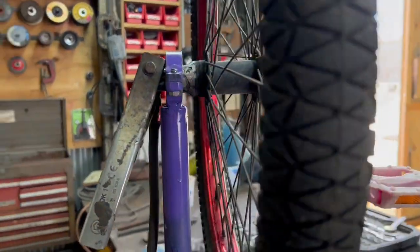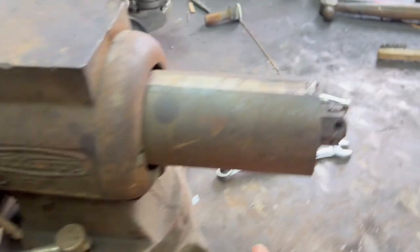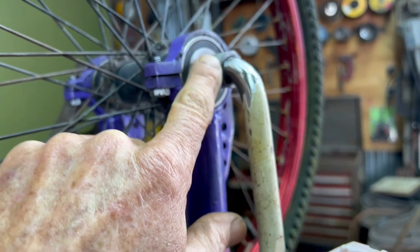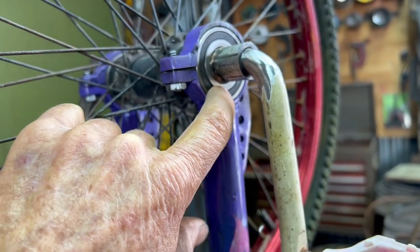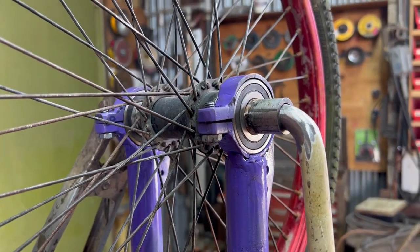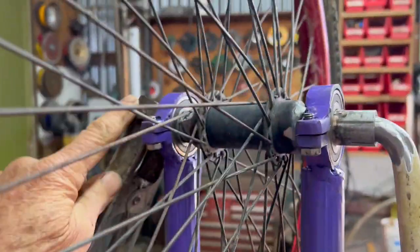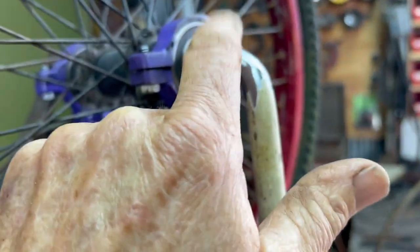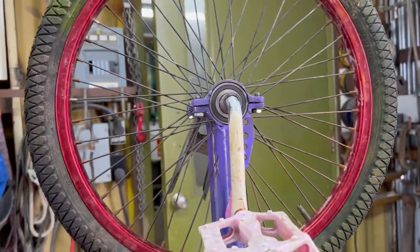I've been careful with my ground cable not to weld through the bearings. In other words, if I were to leave the ground cable on my table like it normally is, and if I were to weld here, the current would run through the shaft, through the bearings, back to ground. And those greasy ball bearings are not a good conductor of electricity, so they would arc, which means I would get little weld bumps in my bearings that pretty much ruin them. So, I'm always keeping the ground moved around so that right now, when I weld here, the current can go straight through the shaft and doesn't need to go through the bearings. And that's what I'll try to keep on doing until I'm finished.